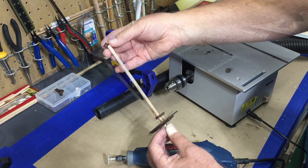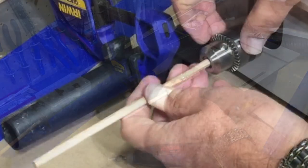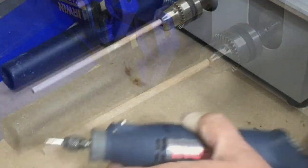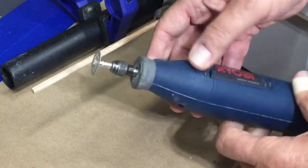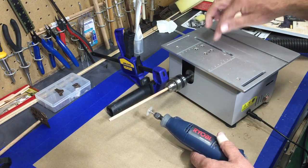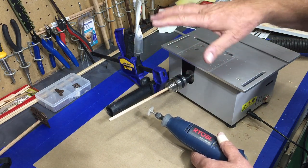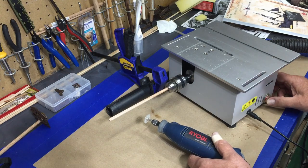I have this oak dowel rod and it needs to taper down so that the fitting will go on there — I've got quite a bit of tapering to do. You just dismantle this, place the dowel in there gently but firmly. This is a diamond surface grinding wheel on the multi-tool. I'll place it on here and gently pull it towards me. Make sure the saw blade is as low as possible so there's no risk of getting cut, and turn the power level down to the slowest speed for the dowel to turn. Let me get it all fired up and show you how it works.